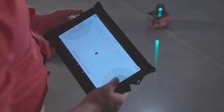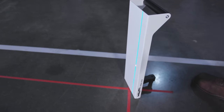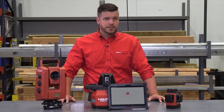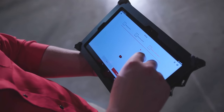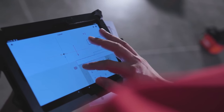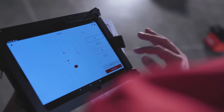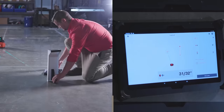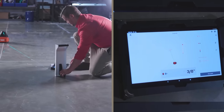Next, give the tool a direction — this will also relate to the jobsite, for example another point on the grid or column line. You can orient the screen to position the tool and set up the line optimally. Then, use the tablet to enter the dimensions from your plan to layout points. The tool will turn and the green laser line will direct you to the point. You'll use the reflector to find the point location along the line as indicated by the tablet.